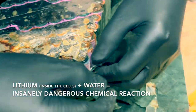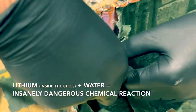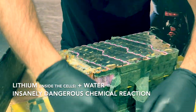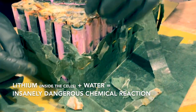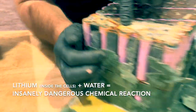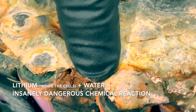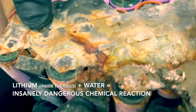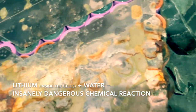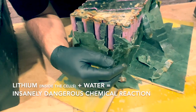So the question is — is something like this dangerous? Oh yeah, because these cells — well, not dangerous in the very beginning, but as soon as this corrodes it happens very quickly. Once you get water in here it starts corroding pretty fast. Look at these bottom cells — look how much corrosion down here. It's going really deep inside the cell already. The top ones are just superficial damage on the surface, but these ones have been sitting here for a long time and this can be dangerous.